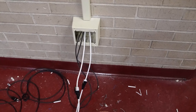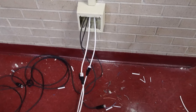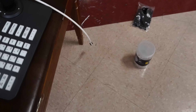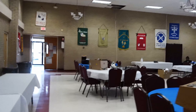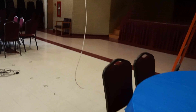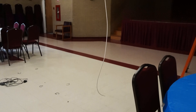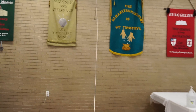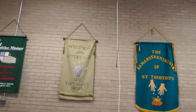Got this connected. Temporarily — I need some keystones, a two-gang keystone for that — but we do have power from here. The other two are connected. The last one would go to the ATEM. I need to put probably a surge protector on this. Let me clean up my mess, and then we're going to terminate the Ethernet on this side which will go to the projector. I'll put all the extra in the ceiling, then terminate the one back here after we actually hang the PTZ.